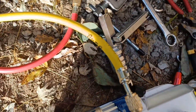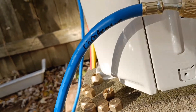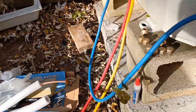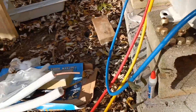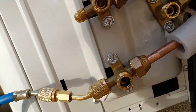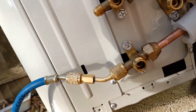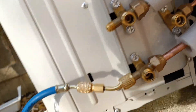I've got mine labeled — the yellow line goes to the pump and the blue line goes to the compressor. There are Allen wrench openings inside each of these valves. After it's vacuumed out you can go ahead and open those, and that will release the freon into the lines.